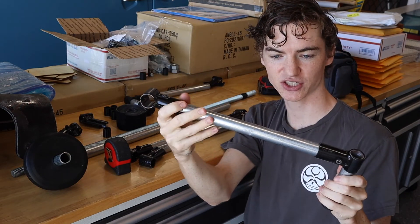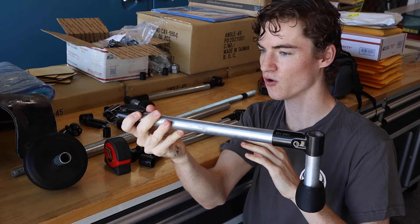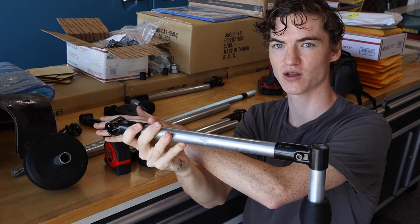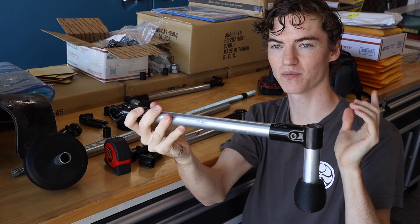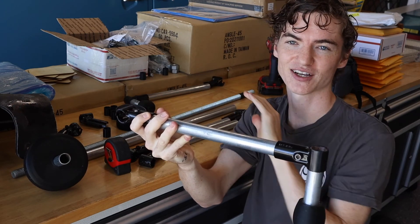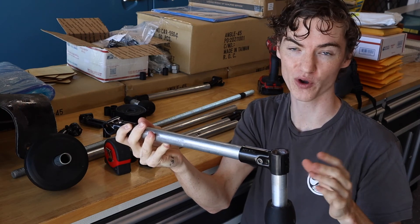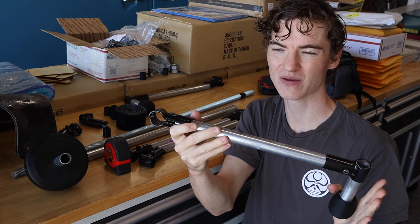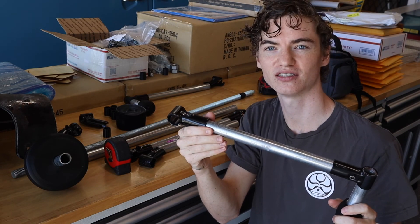Because of the EMT conduit and connections, all these sizes might be different for different animals. For this animal we have 12-inch squat stoppers, 12-inch tip stoppers for the main wheel, and a 25-inch main axle. The wheels go on either side of the axle — it's a 5/8-inch axle — and will slide right over the main wheels. The wheels are made for larger-style wheelbarrows so they're more commonly available at a local hardware store, though I ordered mine off Amazon.